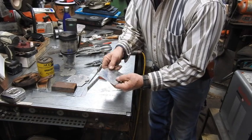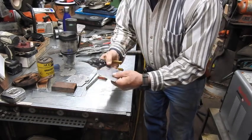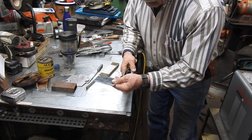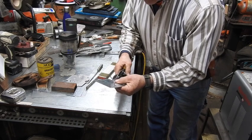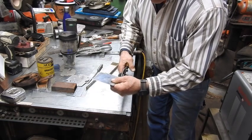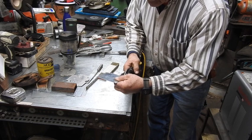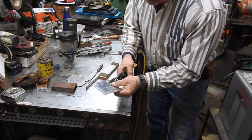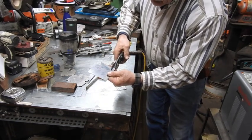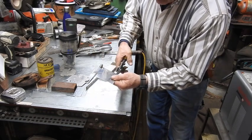Now that you've got these marks established on the four corners, all you want to do is come in here and cut with exceptionally sharp and clean unsprung tin snips on the line, whatever distance it is that you want to cut, and then cut at an angle. Okay, here goes the 3/4. Make sure it's perfectly on that line because that becomes your measuring device. Now the 1/2 inch. And the 1 inch.